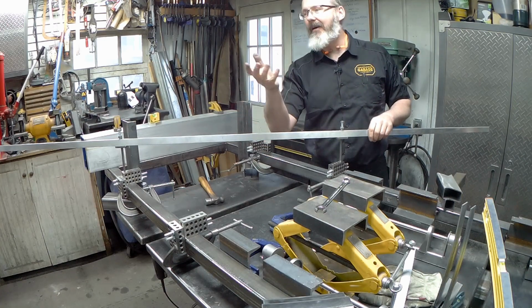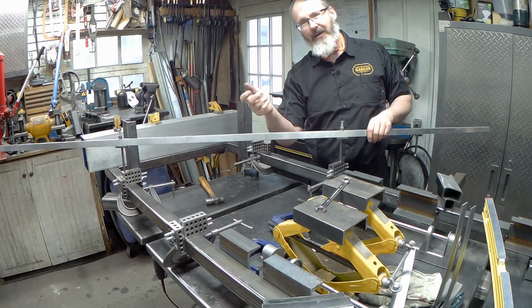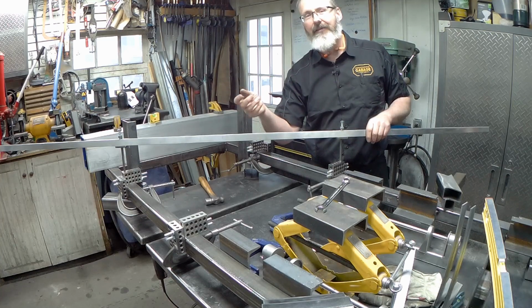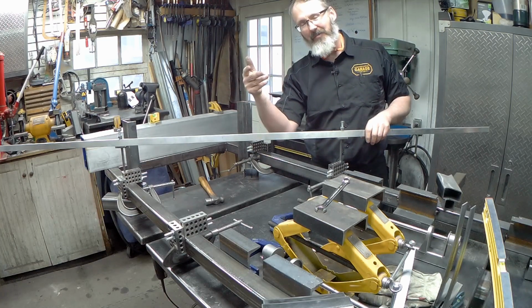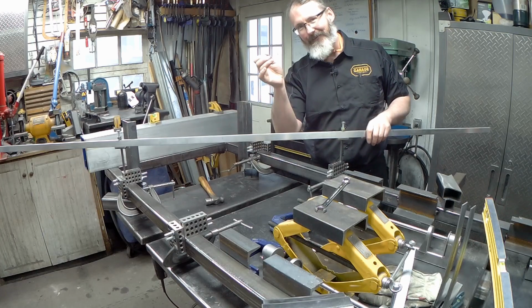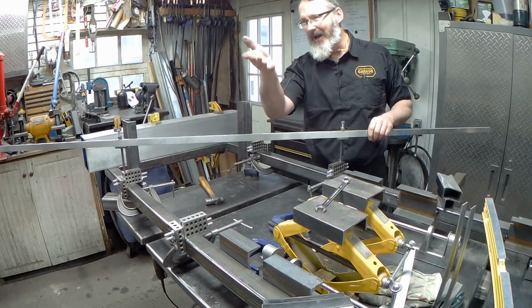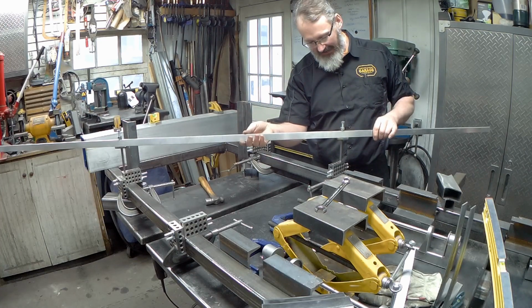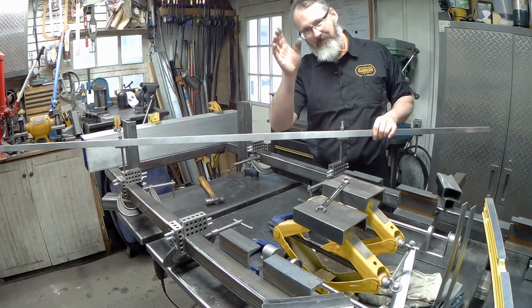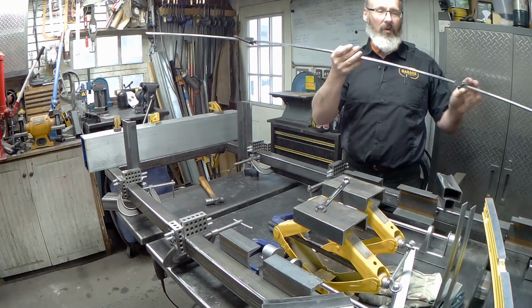It's sort of like using a caliper or a micrometer for the first time. Now, if a real machinist does it, they get it right every time. If you do it and you've never done it before, you're not exactly sure how to measure a round piece with it, because half of it's about the drag and the feel on that particular gauge. You're setting valves with a feeler gauge. It's like, feel. Well, I can tell you that feels exactly the same. It doesn't move. You don't get a sense of it touching. So it fits straight into the hole.